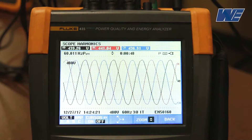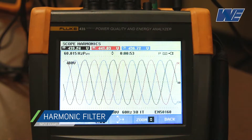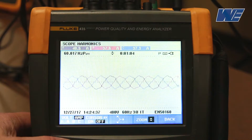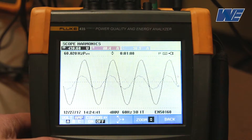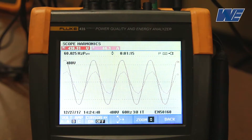Our drive is a 3 horsepower and it does not have a DC link inductor. Now we're going to look at a passive harmonic filter in front of the drive. This is the voltage waveform — the three phase voltage waveform. You can see the three phase current waveform and it's much more sinusoidal than the previous slides with a line reactor or without. Here's an individual phase — we'll look at B.